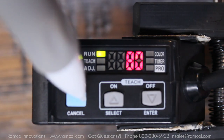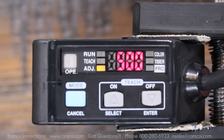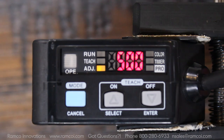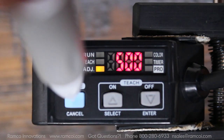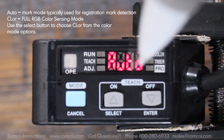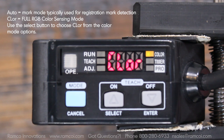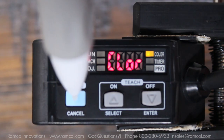I'm going to press and release the mode selection button until the LED next to the color is displayed. Auto equals mark mode, typically used for registration mark detection. Color equals full RGB color sensing mode. I'm going to select CLOR, which stands for color.